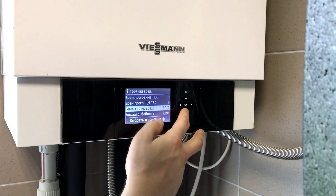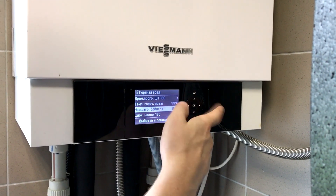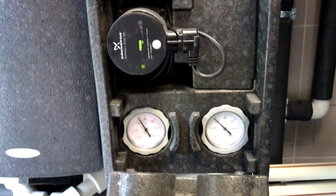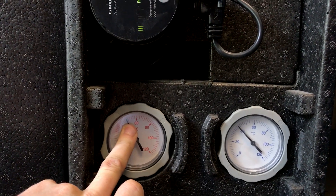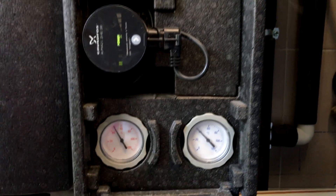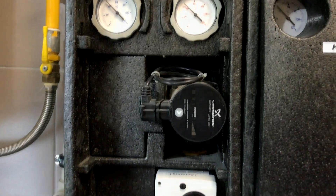Looking at the hot water temperature — it's 32 degrees, which is pretty low. The boiler loading pump is on. Accordingly, there was a flow of hot water from the boiler, the water temperature dropped, the sensor detected it, and the boiler load pump turned on. We can check it on the pump group. The sensor shows a bit less than what the boiler automation sensor detects, which is located in the hydraulic separator — boiler automation info is more accurate. The heated floor pump is off, as confirmed by boiler automation. We can see the temperature starting to rise.